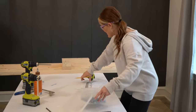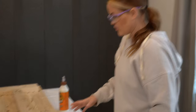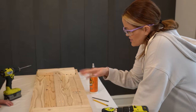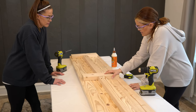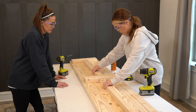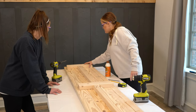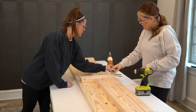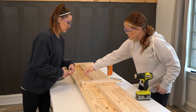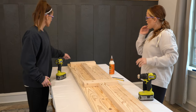Let's move our tools and turn the table. I'm going to show you what we're going to do. This is the frame — these are going to be the top of the legs. Rather than building the legs first, we're going to do it kind of backwards: attach this to the table with glue, then pocket hole these together, and then pocket hole these. I need to mark where to put those — if we just do it off of the center, we can work our way out.